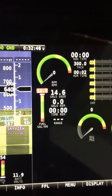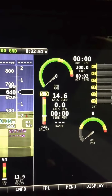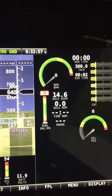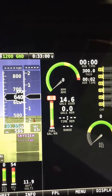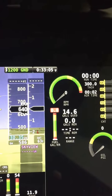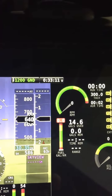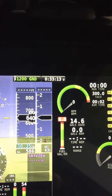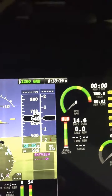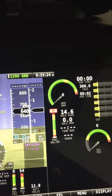The flow rate is dropping fast, coming down to a trickle — and that's it, we're empty. The Dynon says we're empty and sure enough we are. We started at 2335 Zulu and finished at 0033 Zulu, so just under an hour. We drained 14.6 gallons total, with a few breaks to switch fuel jugs, in a little under an hour.